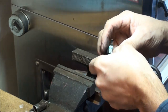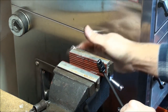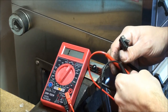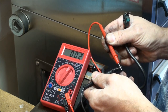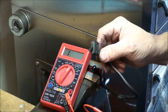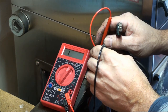Let me take this little screw out — I definitely don't want to lose it. I've got my cheapo multimeter here. Right now we've got an open circuit. If I touch these leads together we've got full continuity — reading about one ohm, which is good. Right now with the switch in this position, with the little flapper up, the switch is actually closed — meaning the hood would be shut. Let's see what the module would be seeing.